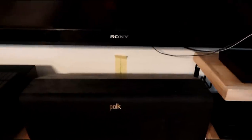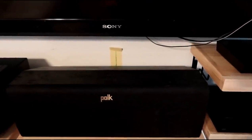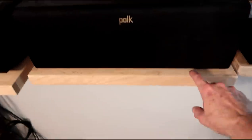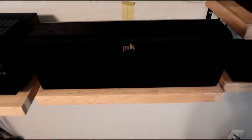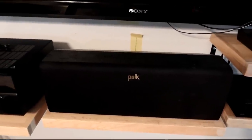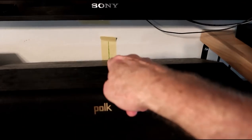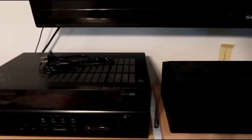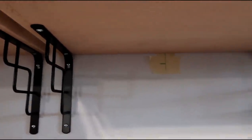And what I'm going to do is route a groove into the back side of it, and then I can just run the wire up the inside of that. I'll stain that the same color as the wood here, and I can get everything to go where I need to go and still keep it looking neat. I think probably what I'll do is have one go up from here to the center, and one go up from here, and then I'll probably just end up running wire underneath here.